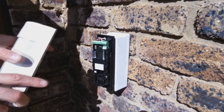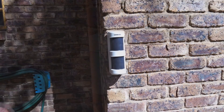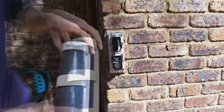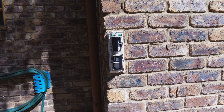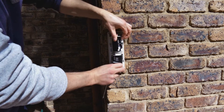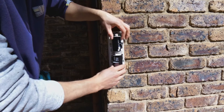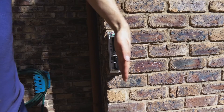This is the TAC-X outdoor PIR unit. When I open it you'll see also two PIR sensing parts. The TAC-X is a little different to the OPTEX - these sensors are actually independent from each other. You can align them to give you almost 180 degrees. It is advertised as 180 degrees, but if you turn both at 90 degrees someone could walk almost right up to the unit without being detected.